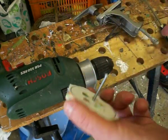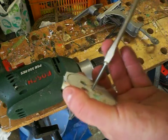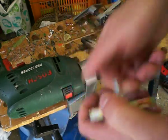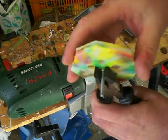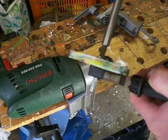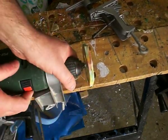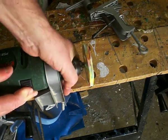I've deliberately made that so that it's a really tight fit. I'm just going to screw that bolt through the central hole and put the nut on there, doing that up as tight as it will go against the plastic. I'm going to grip it with pliers on that side and screw it all the way home tight from the other side. Now I've got to mount that in the drill, with the bolt tight against the jaws of the chuck - that will help it not come undone from the workpiece as it turns.